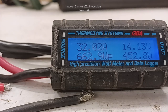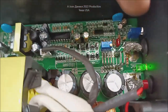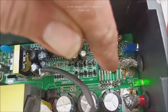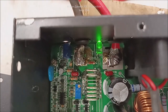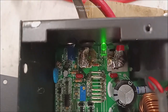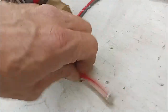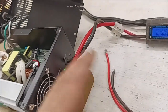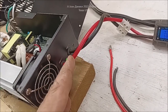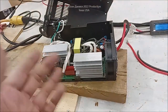So I'm running mine about 32 amps, and the reason is because it's safe. We're turning that trimmer clockwise to reduce, counterclockwise to bring your amps up. This is generally a 55-amp unit, but you'll notice how they've configured it to make it a 45-amp max out. As far as those wires are concerned — if you look down in here, you'll see those large solder pads. I just tinned my 8-gauge wire and soldered it on. What's really shocking is the grommets were a perfect fit for 8-gauge and loose as a goose for 12-gauge. I would recommend replacing it with at least 10-gauge — 10 is fine for 35 to 40 amps. At 45 amps it'll handle it for a while as long as it's not over 2 feet long, but replace it. This is a fault item in it that you need to fix when you buy it.